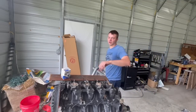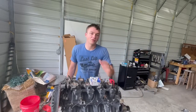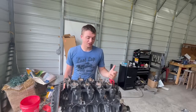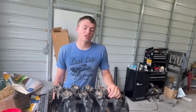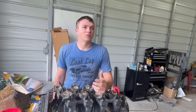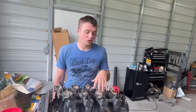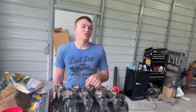To get an intake manifold on this, we first need to understand - this is the bottom of the engine. This engine is normally sitting straight up, one cylinder stacked on top of another. The carburetors are mounted on the side because of the float bowls. This side is typically where your oil pan is, so the intake manifold is where the oil pan would normally be.